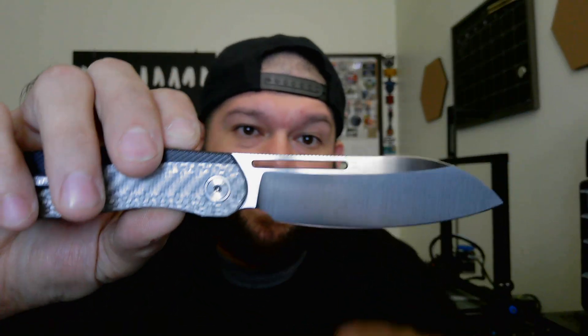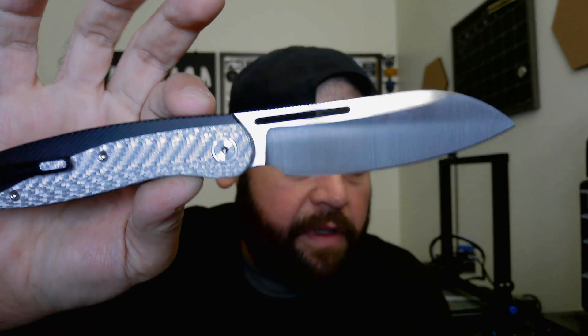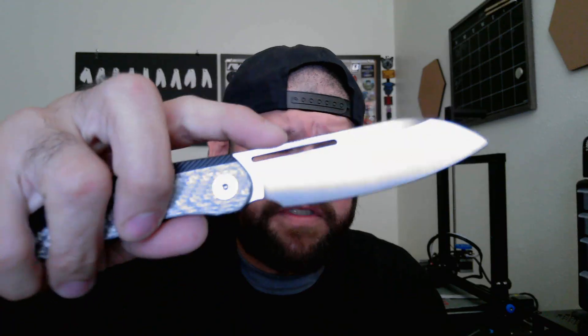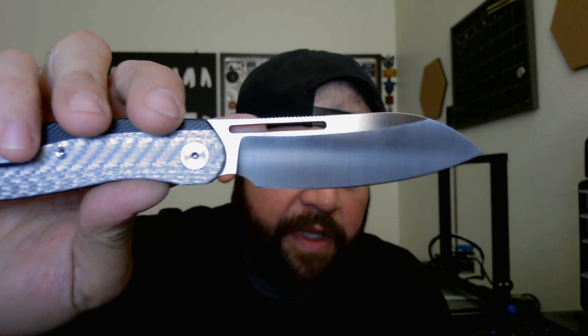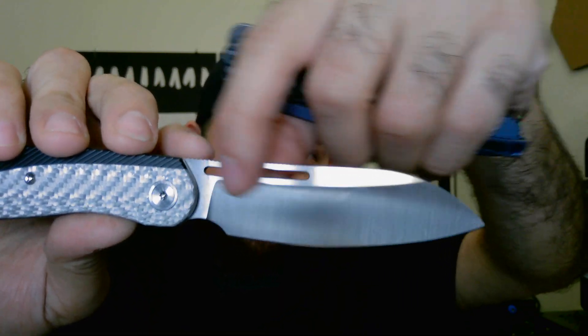The other thing I want to change is I'm considering extending the finger slot. I have it at 1.3 inches right now, which is fairly long, but I want to extend it a little bit more to 1.425 inches, just a touch more. I also might widen it — it's 2.5 millimeters right now. I might widen it to 3.65 or all the way to the grind, though I don't think I want to go all the way to the grind. But I do want to widen it so people can get in there a little bit easier.